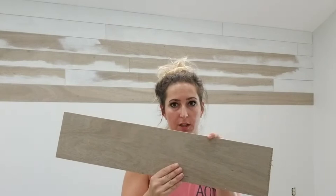Today we're using six inch strips, and you can get six six-inch strips out of an eight by four foot board. One thing to consider is that the last piece they cut is going to be a little bit smaller than the others, so you want to line them up and make sure those pieces are separated. You can use the pieces that are a little shorter than six inches, but use them all on the same strip.